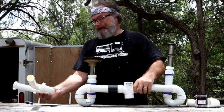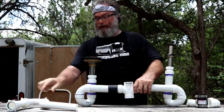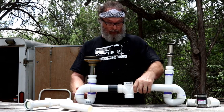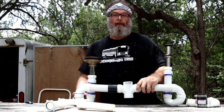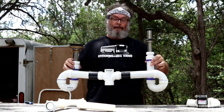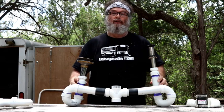I think RVs using these little P-traps — shaking, jostling up and down, sitting in a driveway for a month — the water is going out of that P-trap, and gases are going to come right up into the bus. Which is a deal killer for my wife, because we had a 30-foot boat that didn't have P-traps. Horrible plumbing — the boat would fill up with sewer gas, and that is an absolute deal killer. So these P-traps are massively overbuilt. It's all inch and a half from beginning to end, all the way into the tank. No clog, no evaporation, no sloshing out of the P-traps.